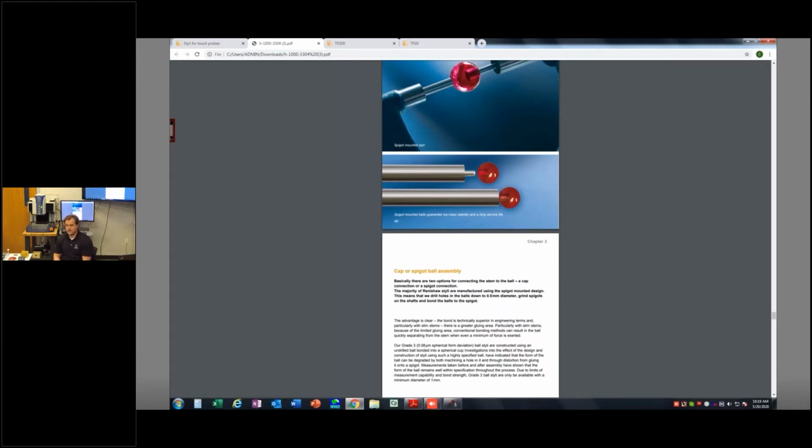Once you have identified the need for probes in 3D measurement, you might start asking yourself what types of probes you want to use. Touch trigger probes like these and the TP200 probes are going to take single points at a time. These do not do the analog scan that you might be familiar with. That would be an SP25 scanning probe. There's going to be a cost premium there, so that's one thing to consider. But these will not do the scans. They'll just take a lot of points and then calculate geometries from those points.